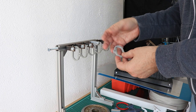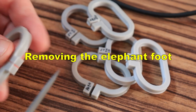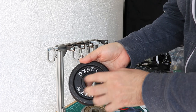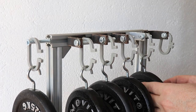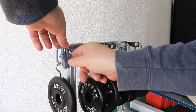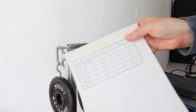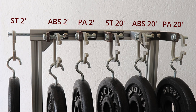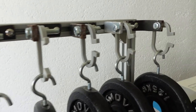The creep test measures deformation under constant load. I measure the distance between two reference surfaces, and I even filed the two edges for more accurate measuring. I had to extend the stand because it was originally designed for 4 pieces. The load will be 1.25 kilograms. This test is designed for FDM printing — maybe this load is too big for resin material. The biggest deformation is on ABS, but basically very similar to the bending test. These are the 2-minute cured versions, and these are the 20-minute versions.